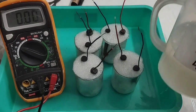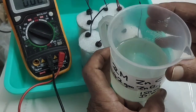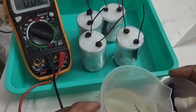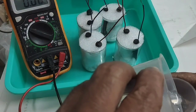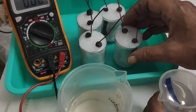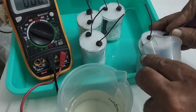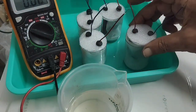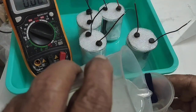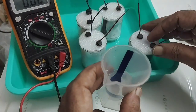The electrolyte is 2 molar zinc chloride — that is 42 grams of zinc chloride dissolved in 150 ml of distilled water. I am going to add this in each of the cells. I will pour it by taking 25 ml at a time. I have poured 25 ml and it seems to consume more — the volume still requires more. So again I put some 15 ml, making nearly 50 ml total added.